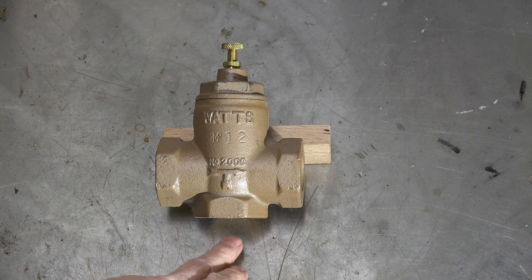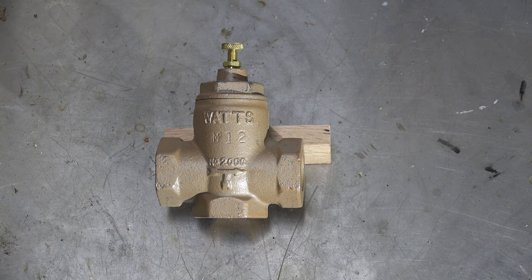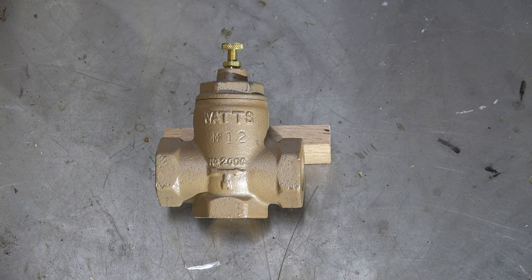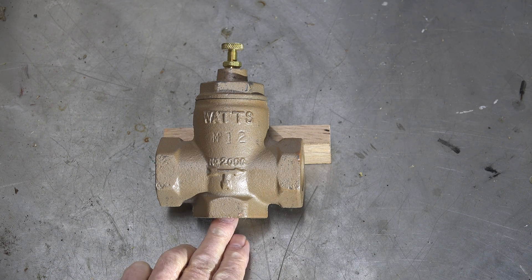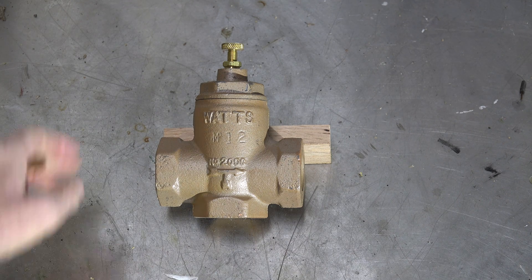This can be piped with just piping this way, with the bottom plugged off — so this would be coming out of the boiler, going to the convectors. You can put a bypass in, or the top of the boiler can come right into here, this can go over to the expansion tank, and this will go out to the convection. It's designed so that if placed where the discharge of the boiler comes right up to this, it tends to take any bubbles in the system and run them out to the expansion tank. If you're using a bladder tank, that doesn't really apply.